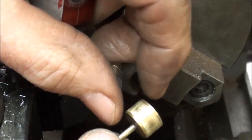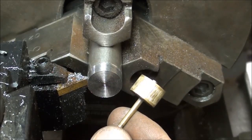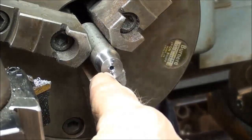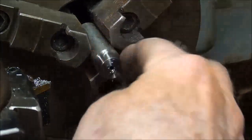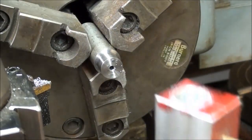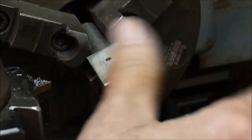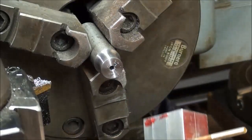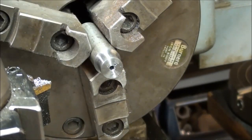The length of the piston is going to be between 5/16ths and 3/8ths, and that isn't very critical. I took it down to diameter for a good fit, drilled the hole 3/32nds, and polished it a little bit with emery cloth, filing down to dimension the last thousandth or so, then checked the fit. Actually I think it needs to be a little freer than that, because I can't have any binding or the engine will not run. So I'll polish just about another half thousandth off, then cut it off with a parting tool and face the other side.